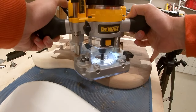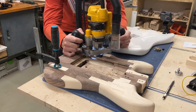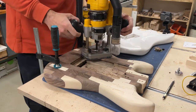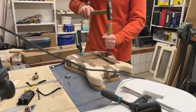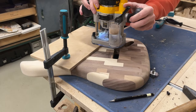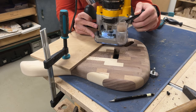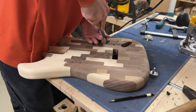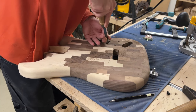In the same way, I milled the shape for the button inlets. Since I use humbuckers as pickups, I only need 2 knobs instead of 3. That's why I made the opening a little smaller, which I will regret very much when inserting the knobs and soldering. Because the edges of the new guitar were milled with a router that has a larger radius than the white guitar had, I can't put the knobs as far to the edge as they were on the white guitar. At first I was afraid that this would affect the look. Fortunately, you don't notice anything because I have one knob less.